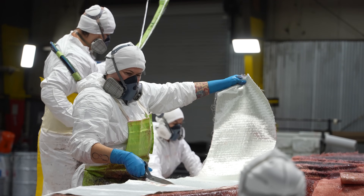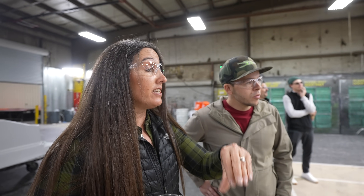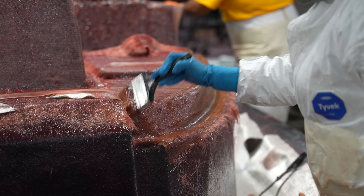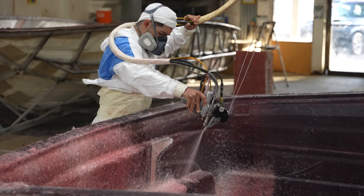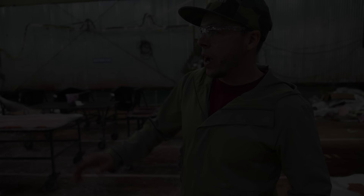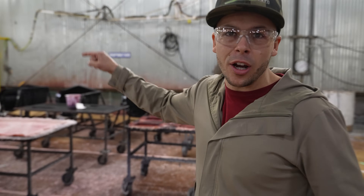The chop creates that consistent shine on the exterior because of the various ways the fiberglass strands go down — it creates strength and consistency of look. Then you add the engineered cloth which gives it more structure. They put different types of engineered cloths in different layers in different areas. They also laminate aluminum into the deck where they introduce things like the tower, so there's a piece of aluminum between multiple layers of fiberglass at high-stress points. Meanwhile, they're also shooting all the little parts like the swim deck and tower components.